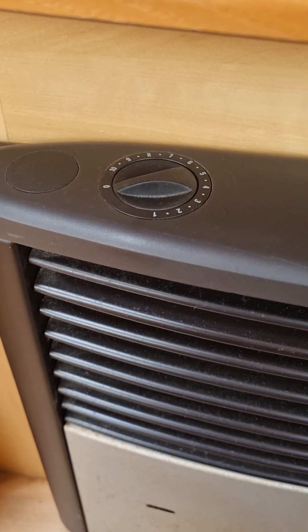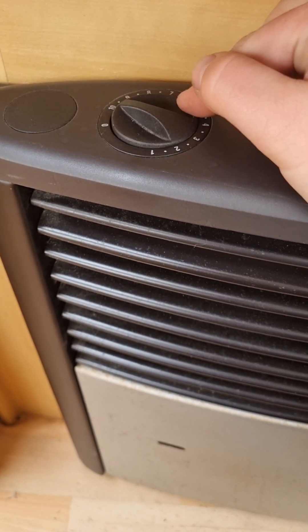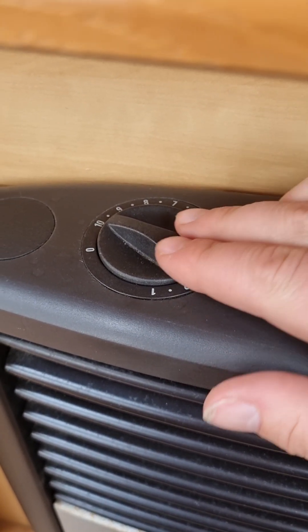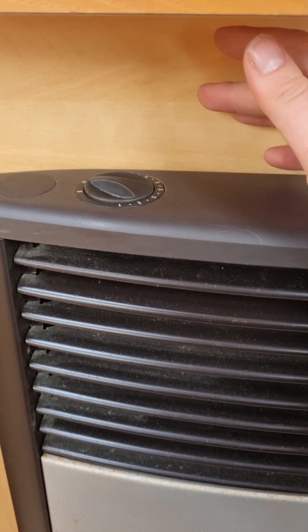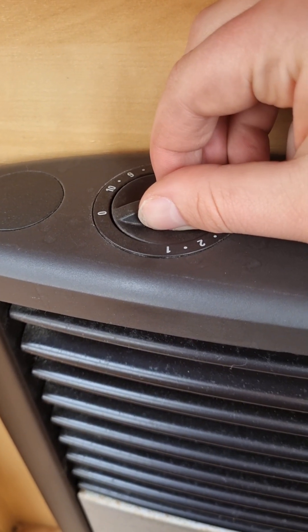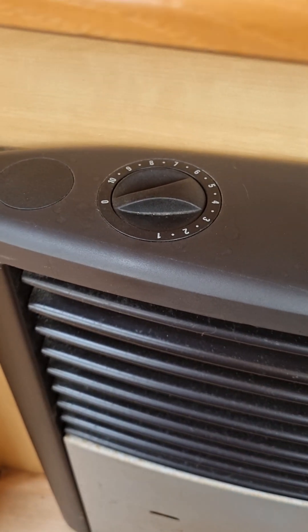On the left here is to run your room heater on gas. When you're first igniting it, you normally want to turn it up quite high. You will hear it start to tick — that's your room heater trying to ignite on gas. While your igniter is ticking, this temperature dial is also your purge button, so push and hold that in. While you're holding it, look through this little viewfinder here — about this far down and about 25mm in, there's a piece of glass that matches the shape of this. Once you get the angle right, you should see a blue flame while holding the purge button. Hold that for a couple of seconds, and when you release your purge button it should kick into a nice bright orange flame, so you know your heater has ignited on gas. You can then adjust your temperature from there. When you go to turn the heater off on gas, go to the 0 and push past that, like you're going back around to the 10, and that will turn your heater off on gas.